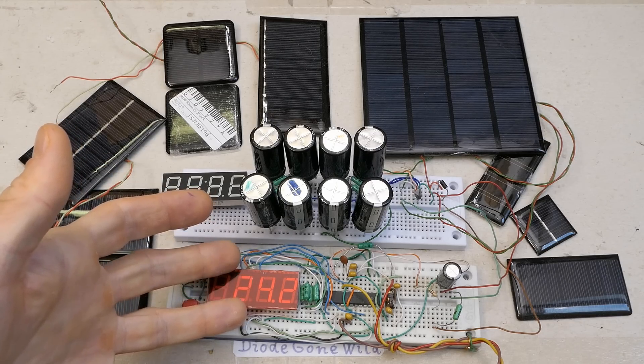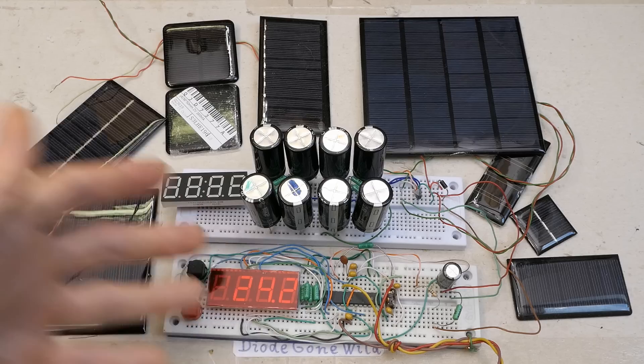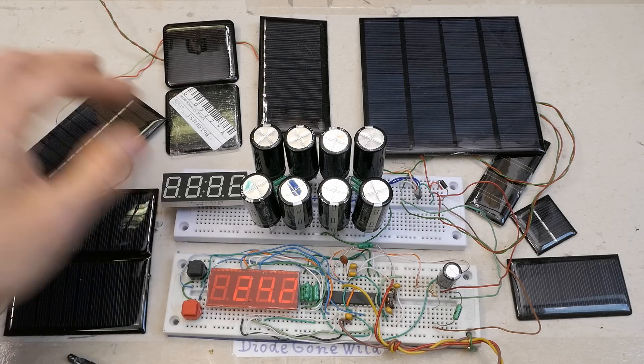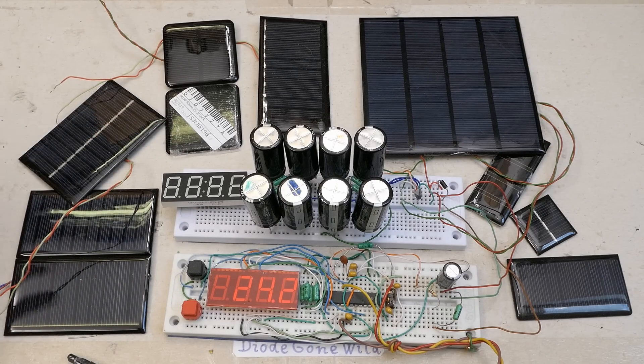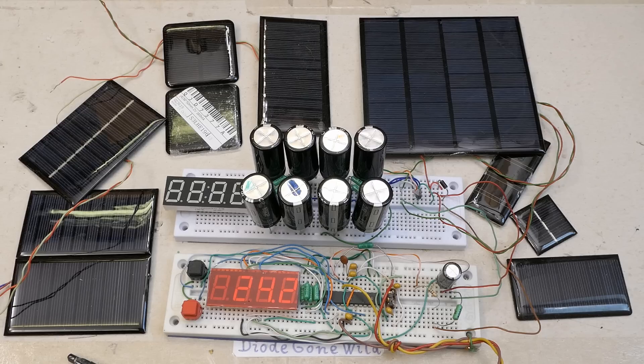The red one is the most efficient out of the lower-voltage ones — red, orange, yellow, and yellow-green. And it's strange that yellow-green is the least efficient while pure green is the most efficient. Both are called green, but yellow-green is about 570–575 nanometers whereas pure green is about 525 nanometers — different green technologies are almost 50 nanometers apart and it makes a massive difference.